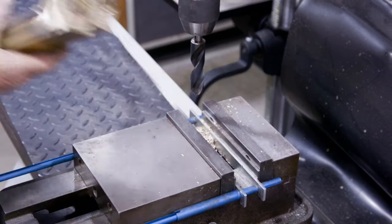For the rest of it, it was ugly — just melting things together. This is why I decided I'm going to grind all this weld down as much as I can and make it look the best I can at this point. You see me put a little bit of beeswax on that flap disc — this is just really good, like with aluminum, it just keeps it from loading up. This material is really soft but the disc does a good job. Things are starting to look a little bit better — I'm starting to get a little more hope that things might turn out a little better.